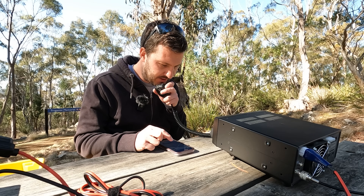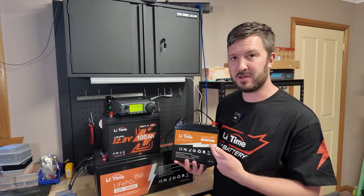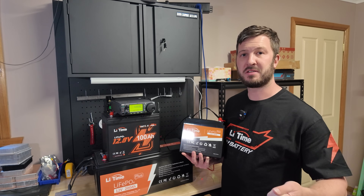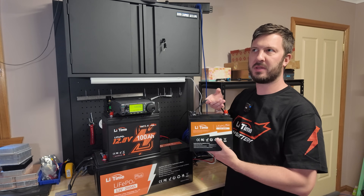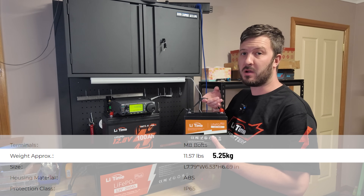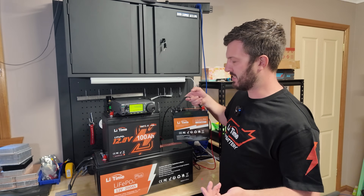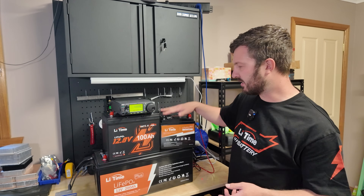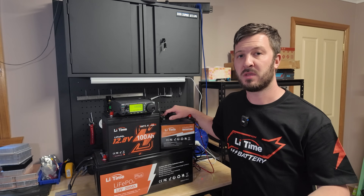I've used this battery for a couple of POTA activations and also for bench testing — if I've run out of power supplies, I'll grab this battery and hook up whatever equipment I need. This is also great for carrying out to an antenna or somewhere outside that doesn't have power. It's probably a little too heavy for SOTA for most trips, though if you're happy to carry it and you're camping overnight on a mountain, a 50 amp hour battery could work. The use cases are lightweight, portable, small operations for a reasonable amount of time.